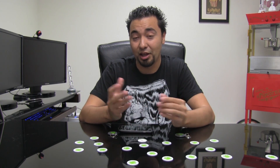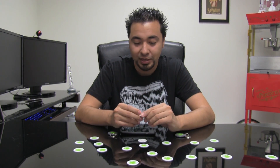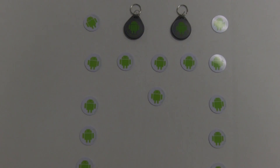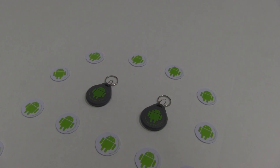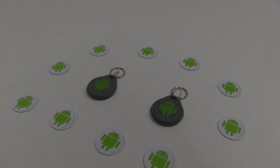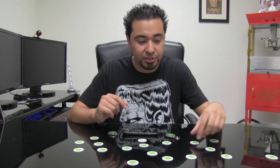The reading distance is about 2 centimeters, but that really depends on the phone. A lot of people ask if these work with cases — I've read through forums that people using OtterBox cases, those really thick cases, have no problems at all. I've tried it and it works just fine. The reason these work with cases is because they use a real wire coil as the antenna instead of the printed antenna on paper stickers — that's really a bonus.